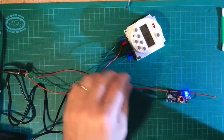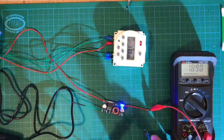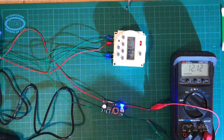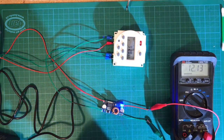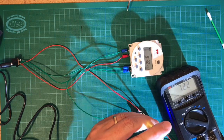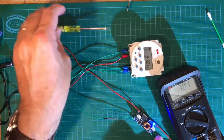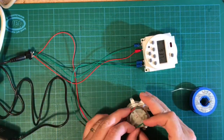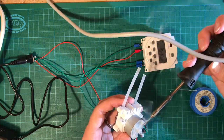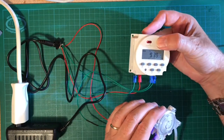After having made all the connections, it's time to adjust the voltage of the power supply. You can see that the reading is 12 volts in the beginning, but with the help of the screwdriver and the step down converter you will adjust it to 7 volts. After the last soldering steps, it's time to power the system up and check if the pump is running.